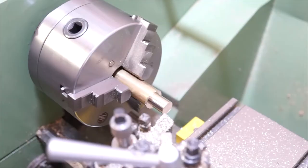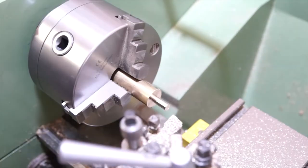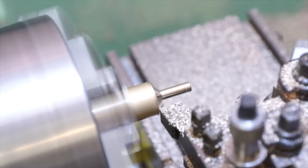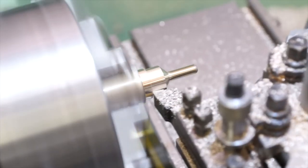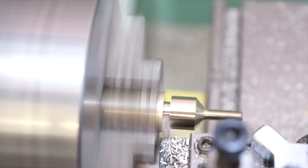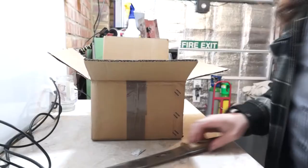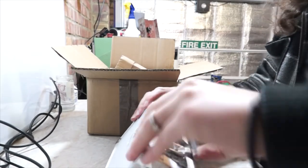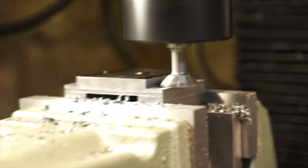Here I'm just turning down the brass to size, then cutting a 45 degree taper using the compound slide, tapping the thread, then final sizing followed by parting off. On the back edge I break the edge, then I add some grooves before finishing up. Then unboxing the ER collet set I've been waiting for.